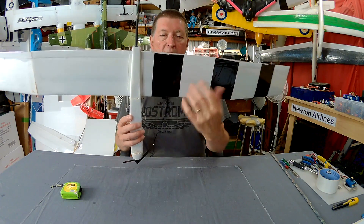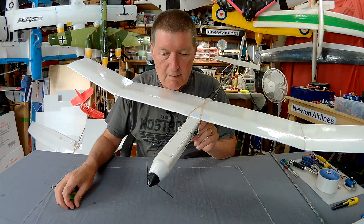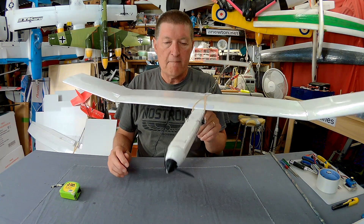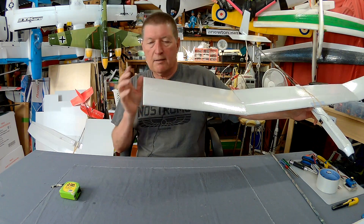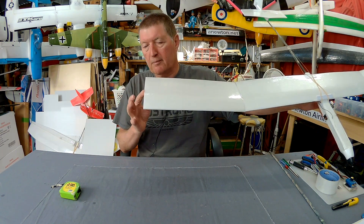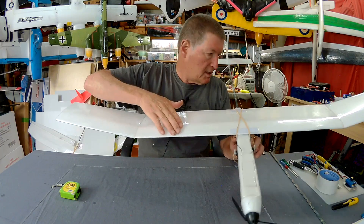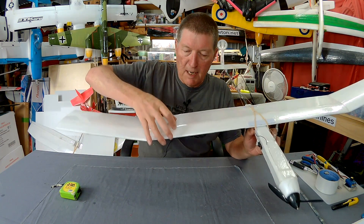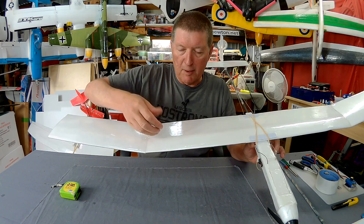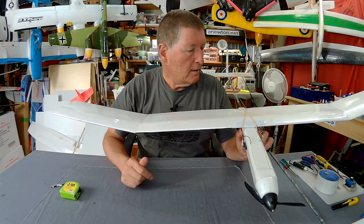Underneath I have some lightweight black tape stripes that don't affect lateral balance at all. I've left the wingtip square because trying to round it off is more likely to ruin performance than improve it. The airflow shape looks good on the wingtip but the centre section is a bit kinked — it's a flat section meeting another flat section. I think I'd put a wider former in there, maybe 30–40mm or two 20mm formers with the spar glued in the middle, which should give a smoother airfoil. But it seems to work well anyway.